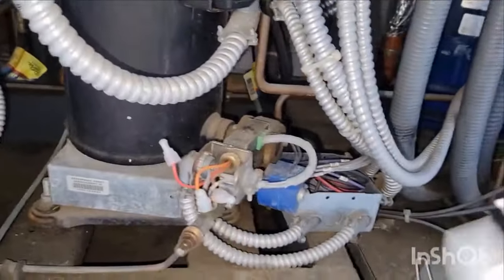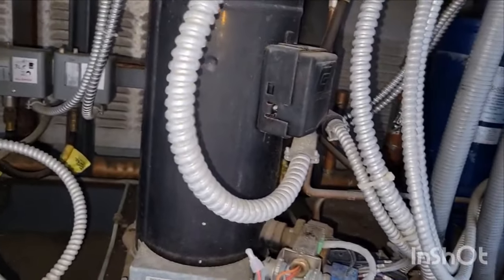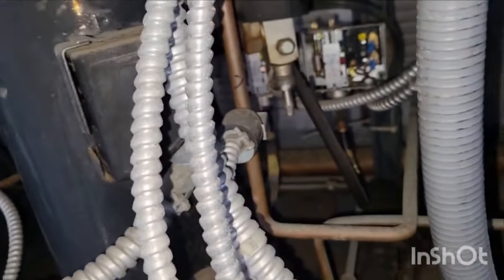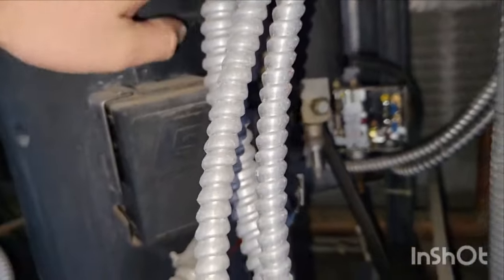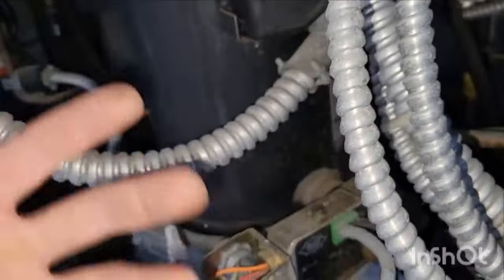So right now, my opinion is this is not isolated properly, okay? So what happens is, part of what happens is, the refrigerant oil will slowly drip down the suction side over time, and it will just gravitate to this compressor. This compressor's not running because it's turned off. As you see up there, it's turned off in those two places.